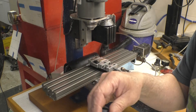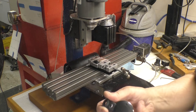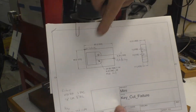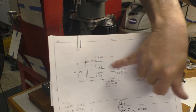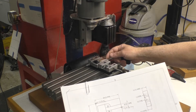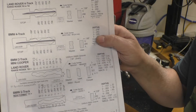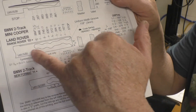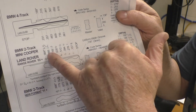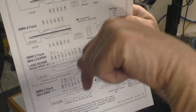Now that the Mini is programmed to accept the fobs, we're going to cut the blades — the physical key part that slips into the fob. I've got a fixture here. This is my drawing of the fixture — I always mark the zero-zero for machining both the fixture and the part. I was able to generate G-code after I found a PDF, which I'll link below, that explains all the different height and horizontal positions. I made a parametric model and generated the G-code based on my key.